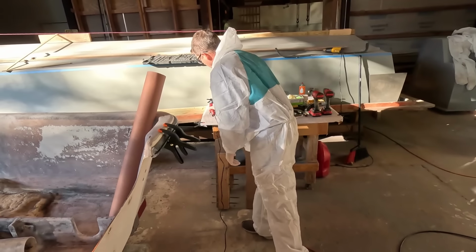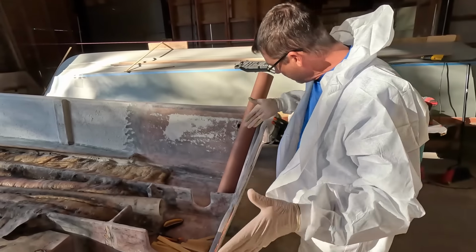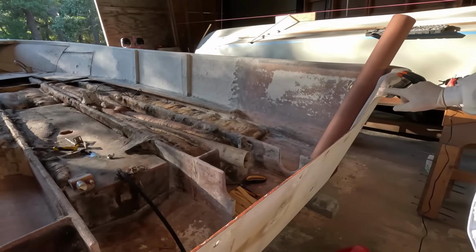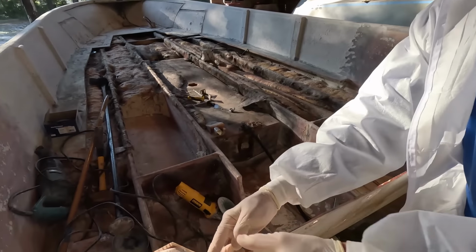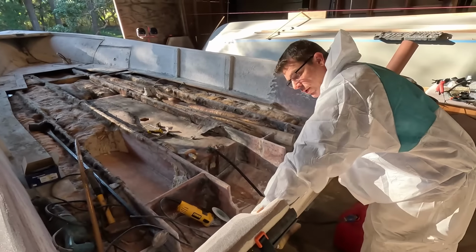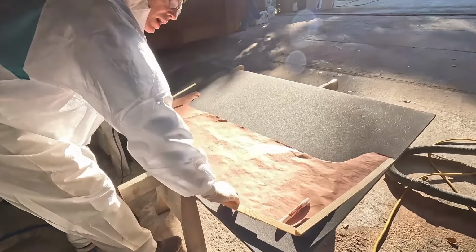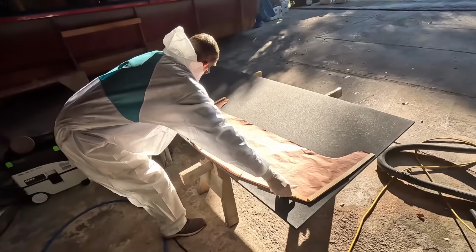Now, if it were me, obviously you could continue on around. You would have to do some trimming and cutting to do this little short piece. Or if you just get this general large cutout, you can set the piece of Coosa in, and then you could come from the inside and just use your magic marker to mark the cutout there. Or you could continue right along, you know, with putting another piece there and then tying them together, then coming right across. And you end up, hopefully my glue has set there, but same deal. Kind of cool. Like to give you folks some options out there as far as ways to get a good result with maybe slightly different methods.